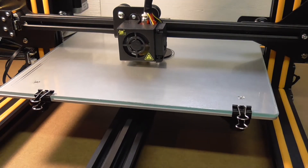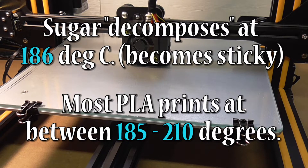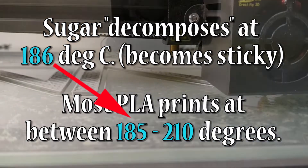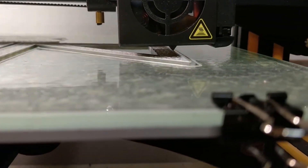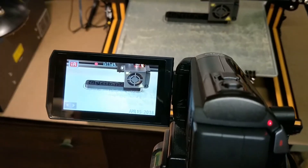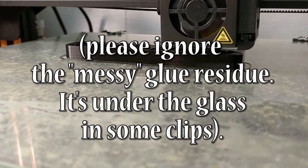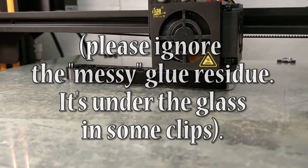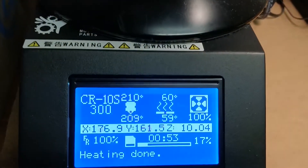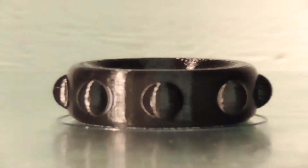Here are my findings. As shown in the Wikipedia link below in the notes of this video, sugar, also known as sucrose, decomposes into a sticky caramel substance at 186 degrees Celsius. That is the lower end temperature for print nozzles that are printing PLA. What I believe may be happening is that as the hot PLA is being deposited directly onto the warm sugar covered bed at 210 degrees, at the point of contact, the hot PLA instantaneously caramelizes the sugar layer, which then immediately cools back down to 60 degrees. I believe this is how the printed object locks onto the bed. More input is definitely needed on this from people with brains and, of course, knowledge.